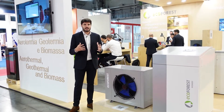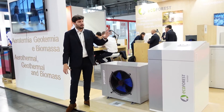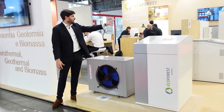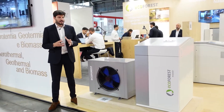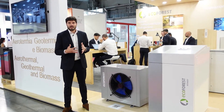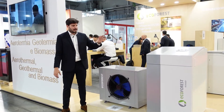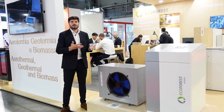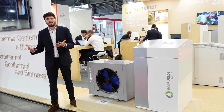There are many advantages in these installations. The main one is that the heat pump remains indoors — this can be the EcoGeo Plus basic unit or the EcoGeo Plus compact unit. These heat pumps are installed indoors, so the refrigerant load and all the refrigeration circuit remain in the technical room, and the refrigerant loads are much lighter than in air-to-water applications or bi-block units.